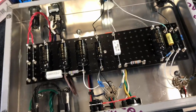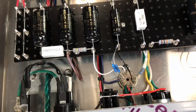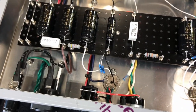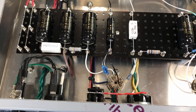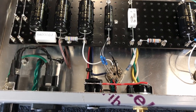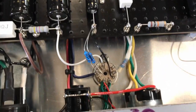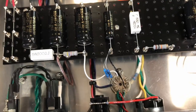The only things that are really different in this amp right now is this artificial center tap that you see here. I try not to use them if I don't have to - sometimes you can get away without it, sometimes you can't. There are two different ways to do the center tap. I tacked it in this way just to very crudely get a center tap that comes off the cathode of the power tube. The way that works is you literally go from each heater, combine the two together, and attach it directly to the cathode of the power tube.